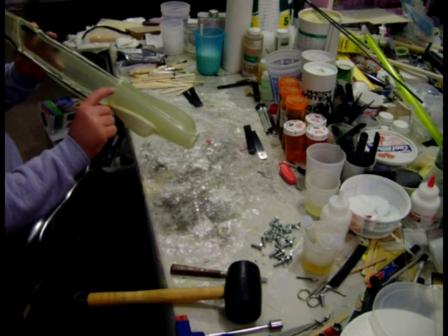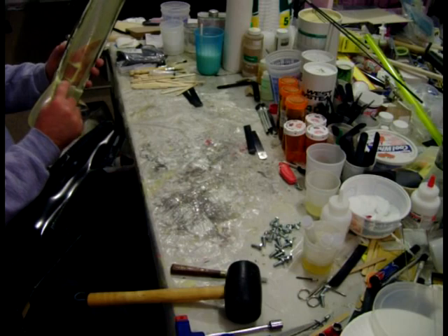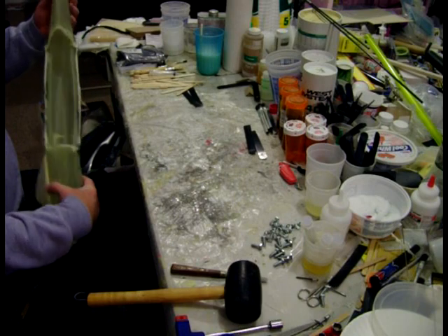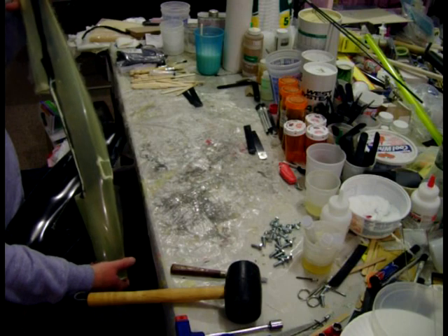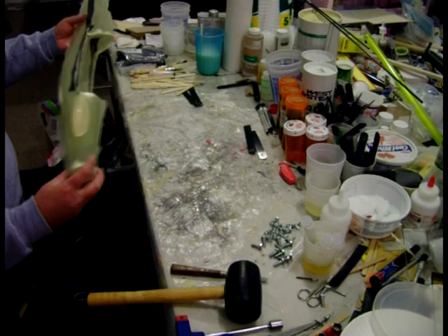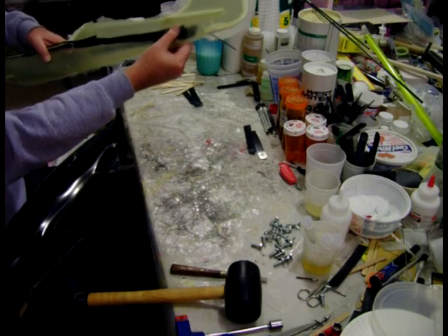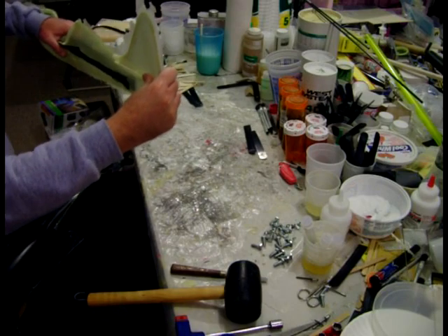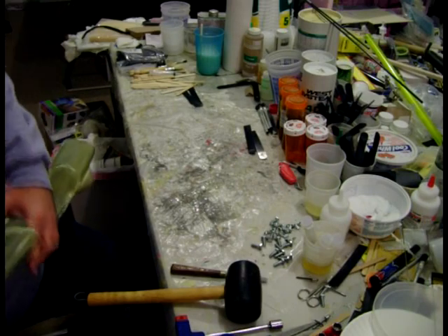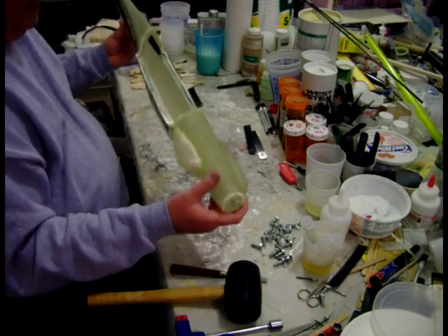I have one spot where the filler ran out on me — I'll have to patch that. The technique for that is to put some filler in it and stick it back down in the mold. I also have one spot back here on the back; I'll do the same thing with it. It will take a couple of minutes to fix those two spots. Overall, it's a very nice fuselage. I've got these stringers to the back here — it makes the fuselage very stiff and it didn't have much weight. So this was a success.